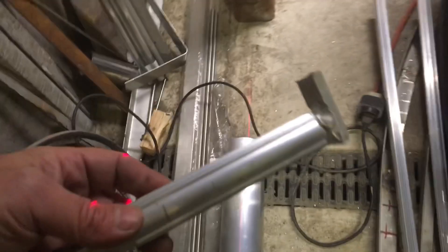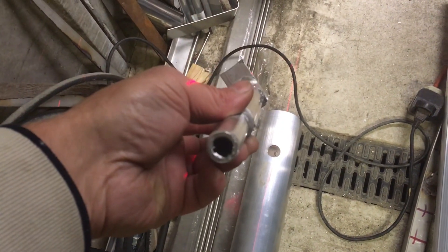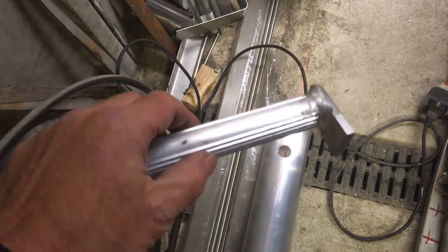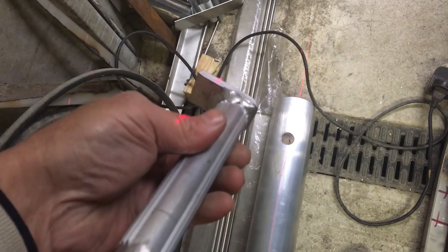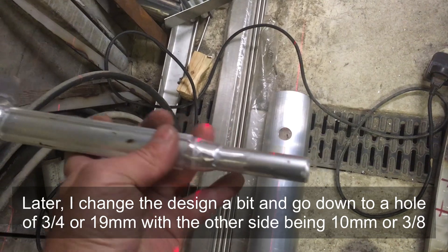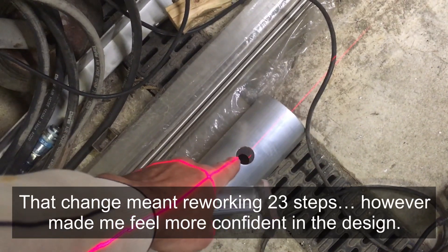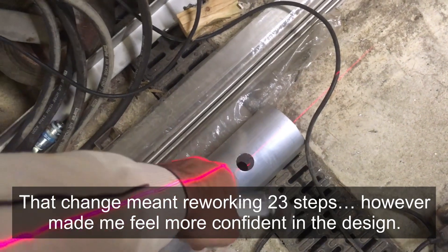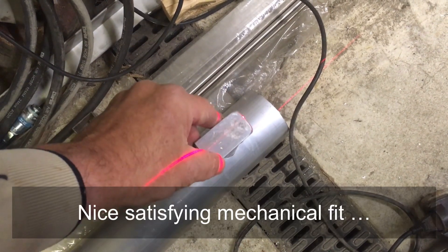I'm doing this but also using a laser to make sure they're all in line. These are one of the steps I've made — obviously not sanded up and flush yet — but I've got a thin bit of three-quarter tube, this ladder rung material, which is really cool for the anti-slip, and then some 8mm by 30 plate welded on the end. One hole is 25mm (inch) and the other is 19mm (three-quarters), and it just sits nicely in there and is really, really strong.